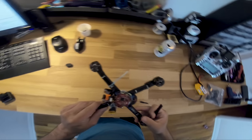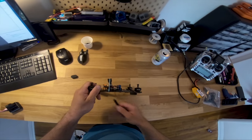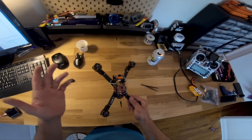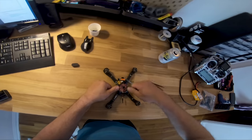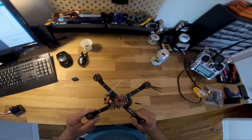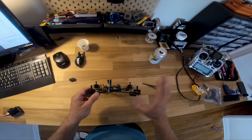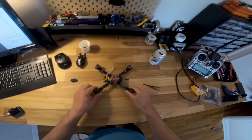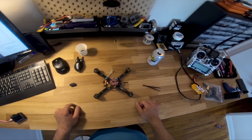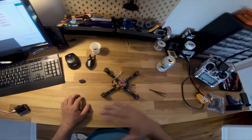They're super tight. Another thing that I always conformal is the main LiPo pads, because I'm terrified that one day my hand will be wet and I'll go to pull the battery off or pick it up and just fry my hand. Right now it's not conformal, it's just a little bit hot glued. I'm going to go fly it later today, and if everything goes well, knock on wood, then we'll conformal it all. That's the way I do it.